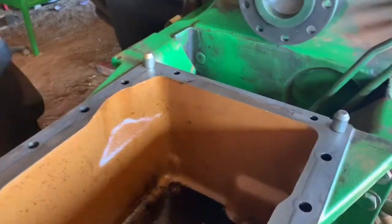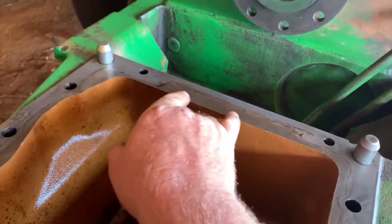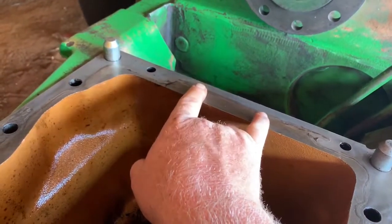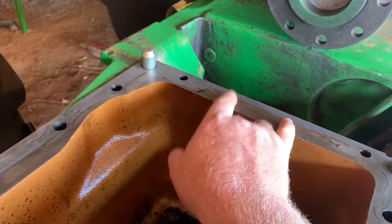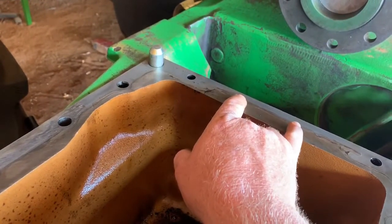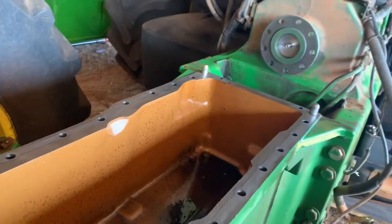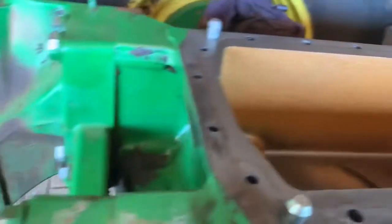Alright, so yeah, on the sump side you can also see they've got the two outside bolts and the two inside bolts that go directly into the aluminium part of the bearing carrier, or the seal carrier, and are not drilled through. But on older models, they should still have these two bolts, which you then have to remove from the bottom side. That's that. So just be sure of which model you have, whether it does or does not have those two bolts.